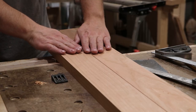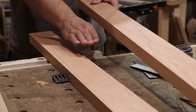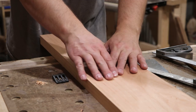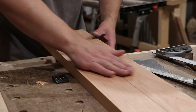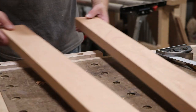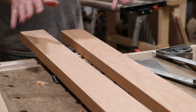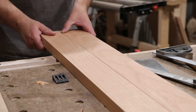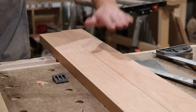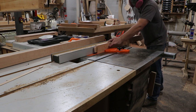This is the front of the desk — the top and bottom rail — with a panel going in between. I'm getting ready to cut the dados to accept the panels. I cut these out of the exact same board so the grain flows from one board to the next pretty seamlessly. Even though they'll be separated by about two feet, if someone were to study the design and grain, they might discover a little hidden Easter egg — that the grain flows from one board to the next. I think those kinds of things add to the vocabulary of the design.